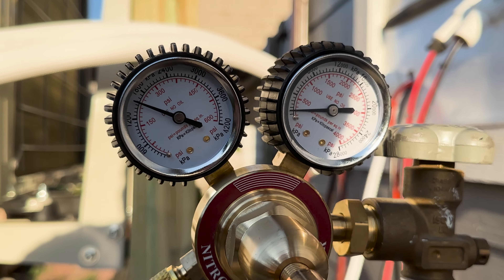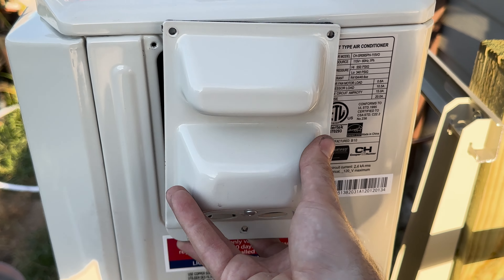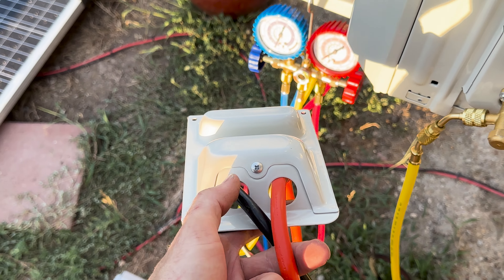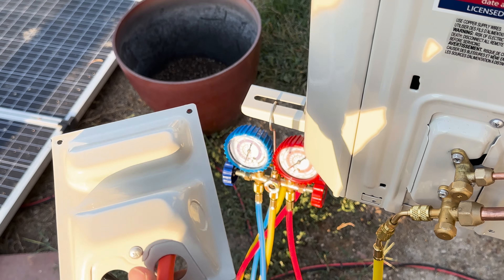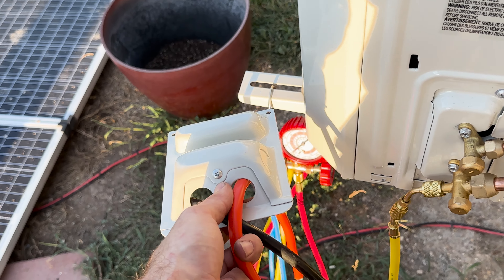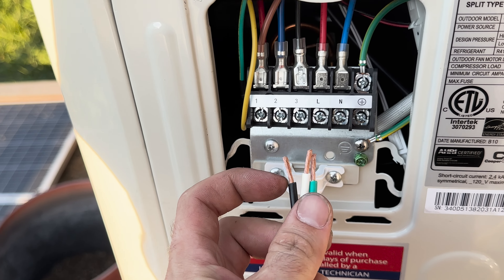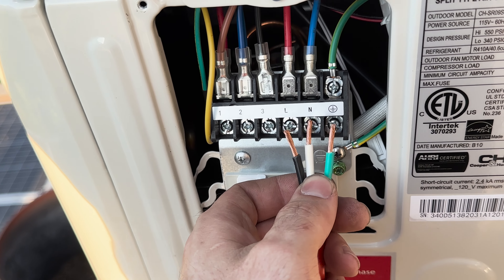While I'm waiting for the pressure test to complete, I'm going to go ahead and install the wiring on the outdoor unit. First you take this little cover off — you have to pop out two bungs and run both your lines through. If you want to make this look cleaner, I'd recommend getting the proper bungs and conduit, which I had to order on Amazon. For demonstration purposes only — the green goes to ground, your neutral is your white, and your live is your black. You need to put connector ends on this. So that's how you wire it. This is a 120-volt unit, or 115 volts. If you're running a 230-volt unit, it may be different because you'll have two phases going in instead of a line and a neutral.